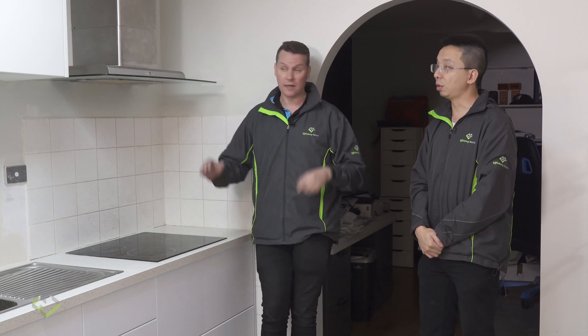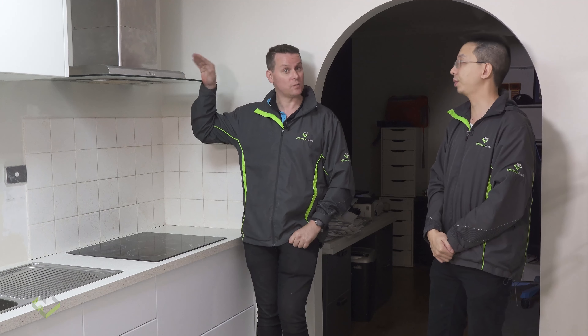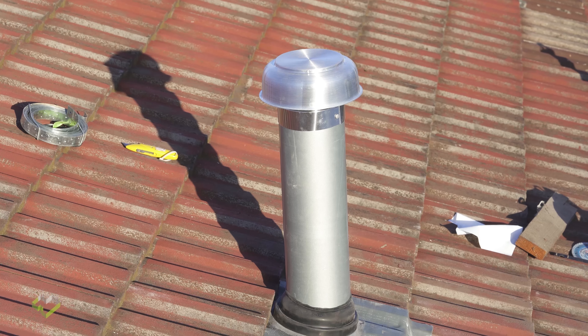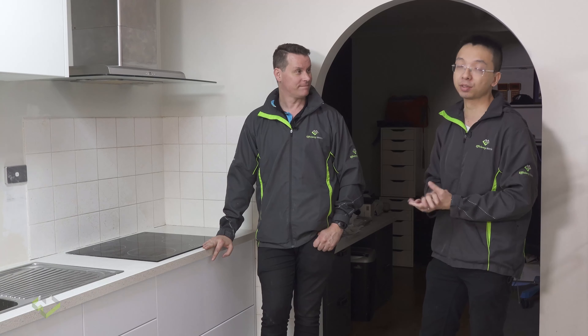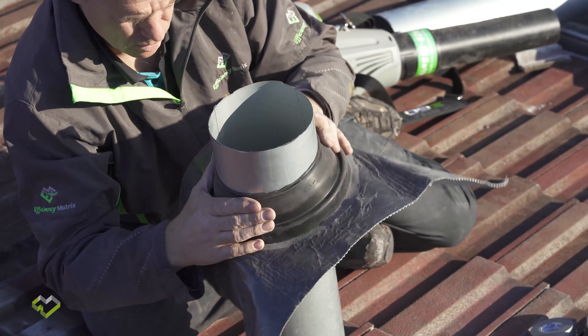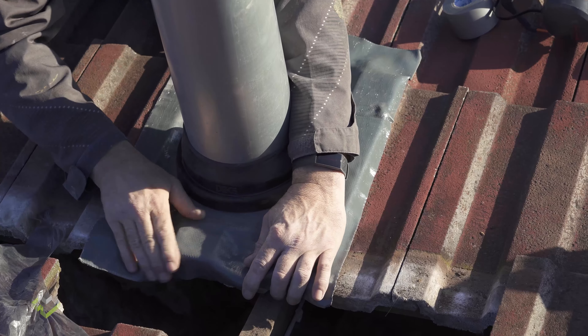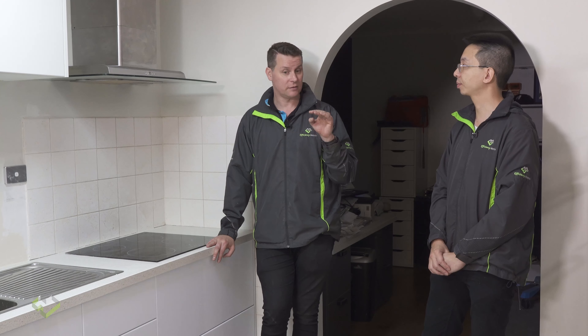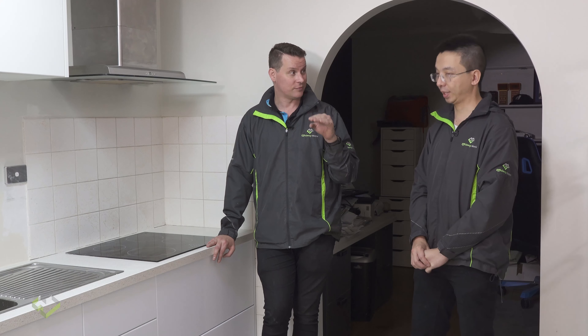Draft stoppers need to be maintained as well, because of all that grease. There should be a draft stopper integrated in these systems — that's one thing to always look out for. This one has a draft stopper in it and it's been ducted and vented via a metallic flue — not plastic for a kitchen, because of the potential fire hazard. If your home has a range hood exhausting directly to the roof, it's not a big deal to get it redirected to the outside. There are plenty of products — just call a roof plumber and most can fix the issue in half a day. Make sure there's a draft stopper integrated, and also ensure it's an inspectable and cleanable damper.